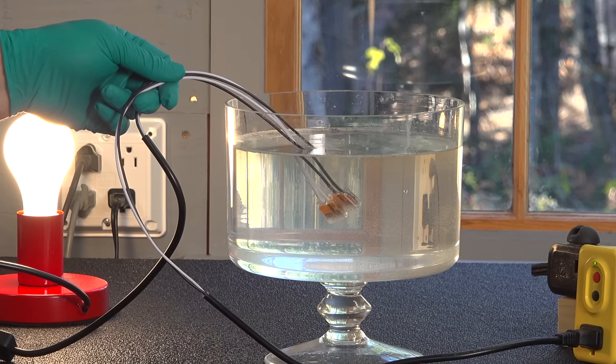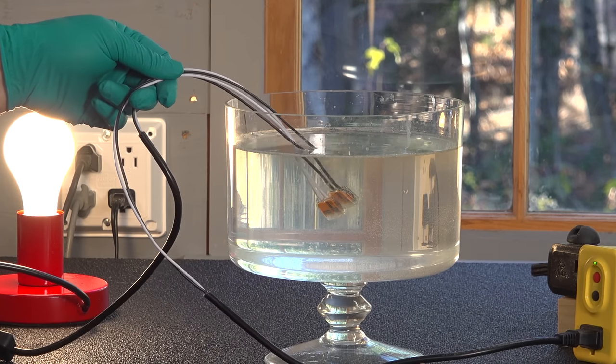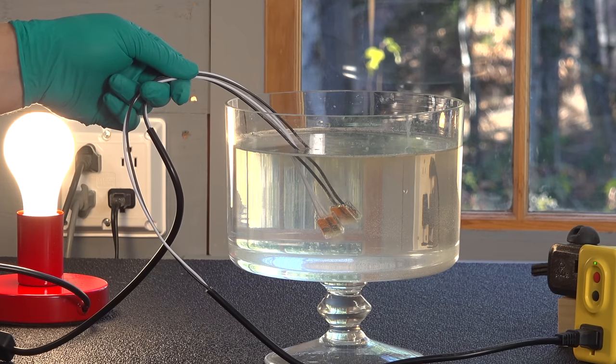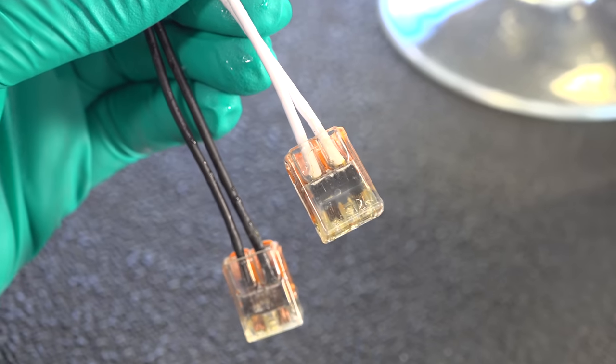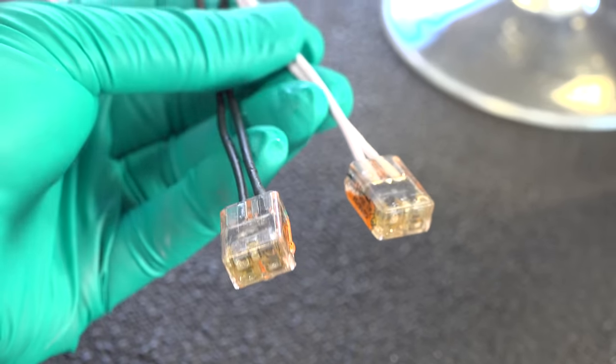Instantly I'm starting to hear some funny things — you can see bubbles on the end of the connection because the circuit is getting shorted. I did notice that this GFCI protector wasn't doing anything at all, and that's because it's lacking a ground. These Wago 221s are getting cooked because they aren't waterproof. If these new gel boxes don't maintain a waterproof connection, I should instantly see some sizzling, maybe some bubbling, and I'll know that these boxes have failed.